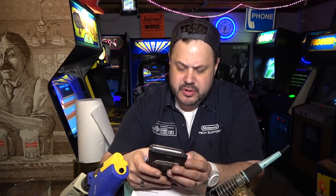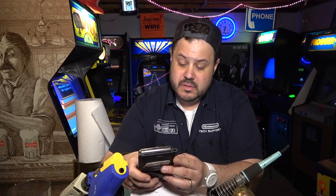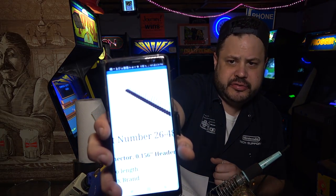Let's see if I can find it for you real quick. So it's greatplainselectronics.com. That's where I buy all my pins and stuff. It's a great place. And you go to connectors, they have 0.1 and 0.156 square. So the 0.156 is what you need. Yeah, 0.156. So you need those headers.